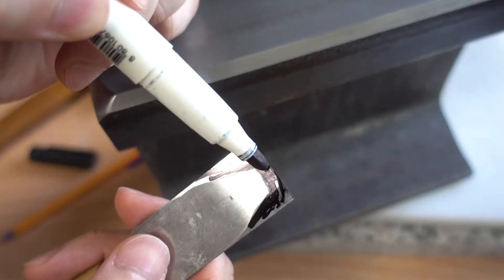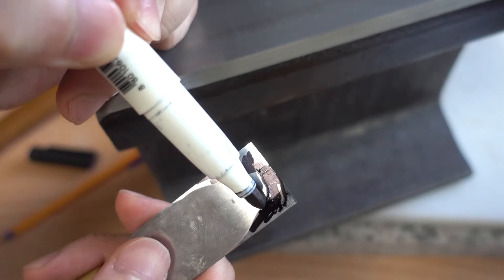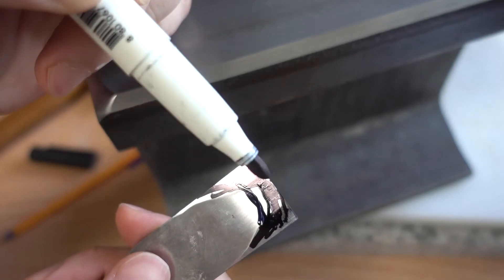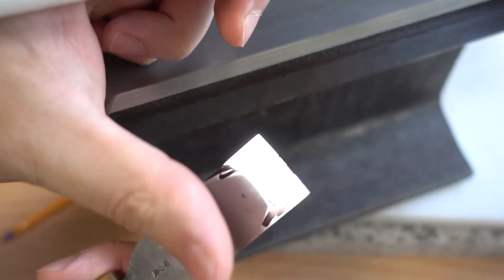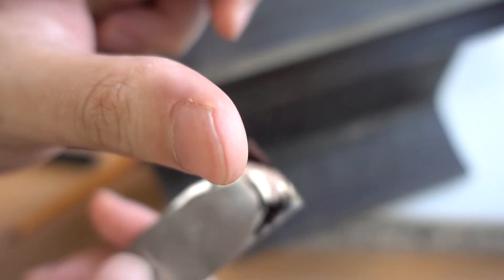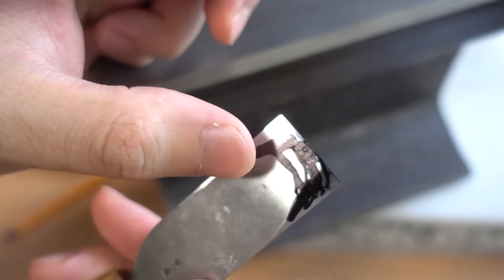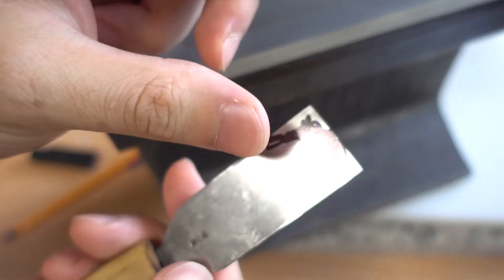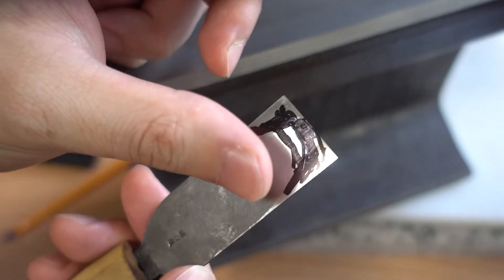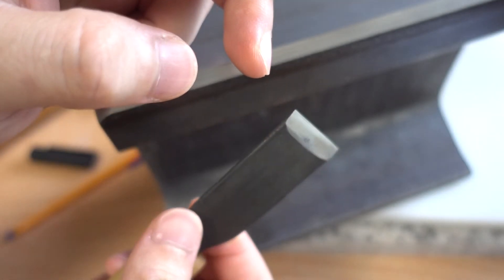If you sharpen and use up this much steel, you need to do the hammering again so that you have a flat spot again. Don't try to make it flat all the way by sharpening the whole steel — you will remove a lot of metal and won't get much life out of your knife. If you sharpen all the way here, you will have a very thin edge and eventually it will be gone before you use up the whole length of the steel. So I'm going to show you how to sharpen this.